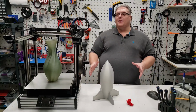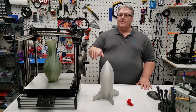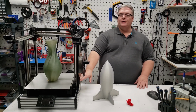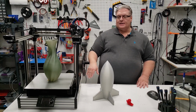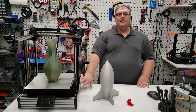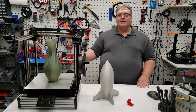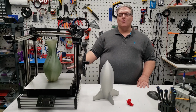Now, some of the other mechanical things that are really good callouts here is that there's 2 steppers for the X and Y, just like a traditional printer, and 2 steppers down here in the bottom case for the Z axis. Now, they're driven by independent Z-steppers, but we're using an SKR version 1.4, which has pinouts for dual Zs right in there.